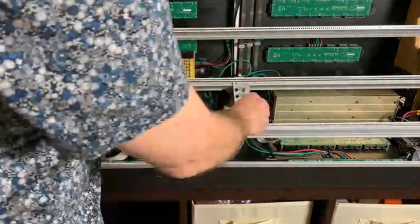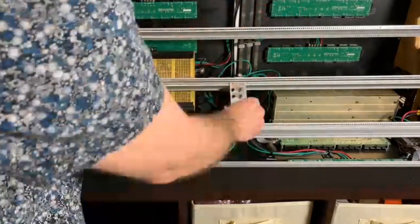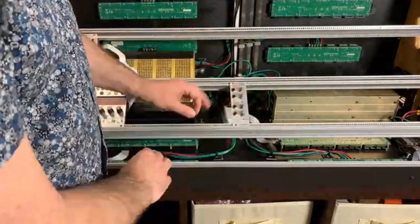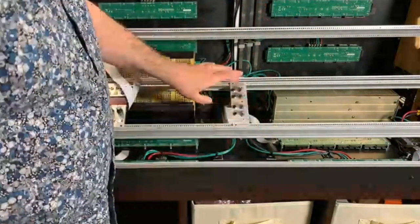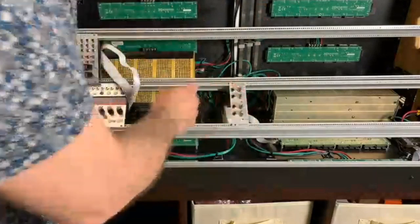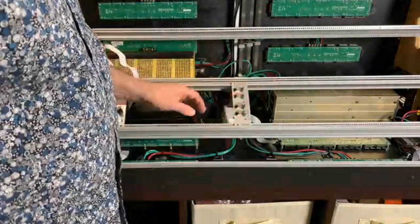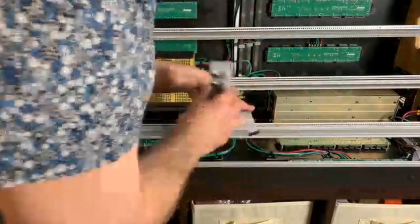So you might need to increase the length of the gate coming out of some modules to trigger sample players correctly. And also, as I've gone more into modules that have choke controls on them, I've been wanting to set the length to be some musical division, like an 8th note, 16th note, or whatever. When you just have a very short accent to open or close a hi-hat, that's not really the full note. You're not really hearing the full effect. But by having a trigger delay with length controls, I can now dial in, when I hit this with an accent pulse, how long that hi-hat is opened or closed, as opposed to just being a blip. So this is one of those unusual utility modules that I consider to be essential in my systems for the type of really rhythmic stuff I do.